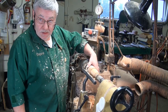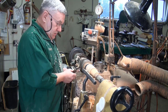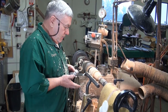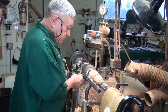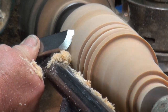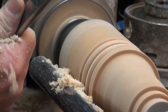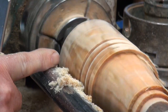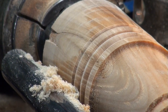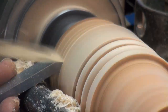Larry wants me to switch hands and cut towards the camera. As a woodturner you've got to be able to turn both left and right. So I'm going to make a planing cut going that way — this would be the long point up. Listen to that cut. We picked up a catch at the beginning of that cut where this wood was missing and it's flapping. We're going to get rid of that and make that cut again. You can probably see this peeling cut better from this direction.